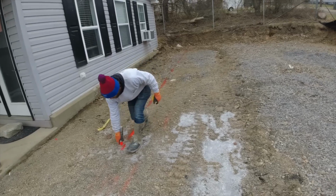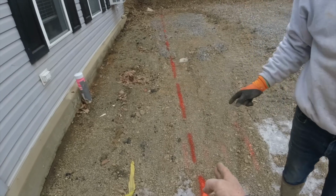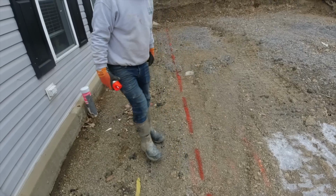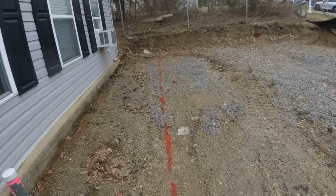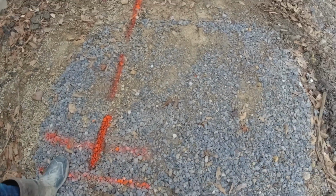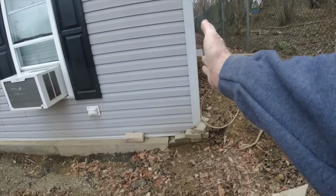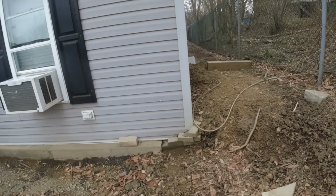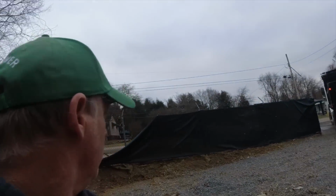So is that the wall or is that footer, Steve? This is wall. Okay. The outside of the wall needs to be 5 feet from the building. Okay. So our footer 8 inches over? Should be, yeah. Okay. 2-foot wide footer. So I'll take a line 8 inches over, and then make those. Is this our corner here, Steve? No, I haven't. No. Okay. What are these ones here? This is where I thought he wanted the sleeves put in, but I believe he wants them right here. We're going back even with the corner, roughly? I need to pull a measurement because they're 29.9 from the front. 29.9, okay. Okay. So we'll get this squared away. Talk to you in a minute.